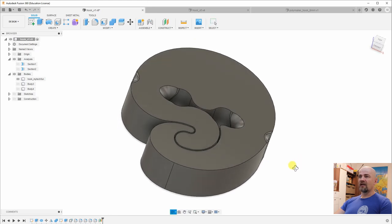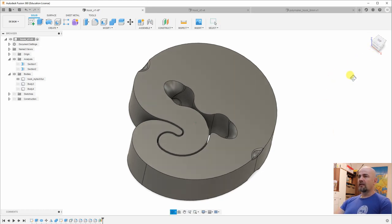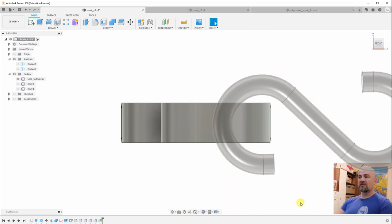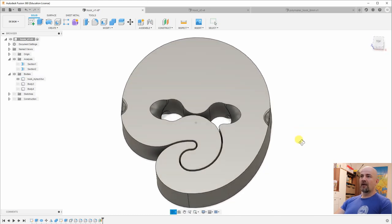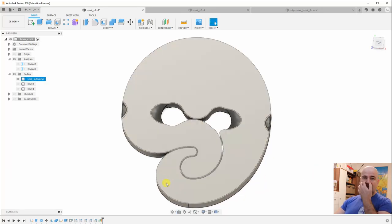I tried to avoid any sharp corners, as you can see the design is a complete curve, because sharp corners tend to start cracking at those places. The next step was to use the maximum thickness for this hook, since it has to fit inside the metallic hook. The given dimension is theoretically 16mm but with a tolerance of plus or minus 1mm, so I used a thickness of 15mm. I also designed it so that if this part starts bending, it will align to this surface and only the outside may bend under very high load.